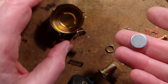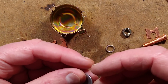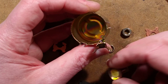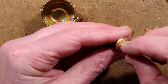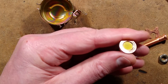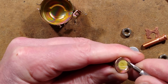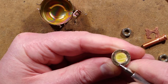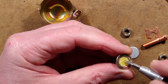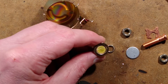I wonder if that's what's used in cars as well. This looks like an aluminium disc at the back — oh no, it's steel. It is a steel plate at the back, presumably to absorb the impact of that solenoid going into the core. And why does this have a little cap in it? This needs further exploration. I think it's filled with resin — I think we'll have to explore this. I wonder if it's hollow, or they've added something else in there. Like lead? I shall take that out and we'll explore it.